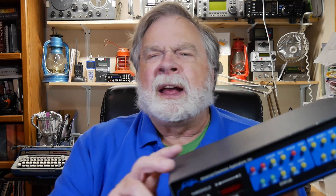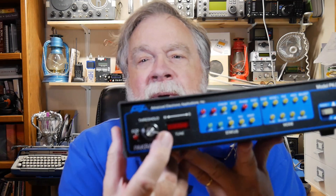I once wrote to the ARRL and said, shouldn't the standard be 200, because this thing is much more common than real RTTY machines, and they're all 200, so since most people are using 200 we should make that the standard. Well, they wrote back and said they can't do that. It's still 170, but it had a little tuning indicator right here.